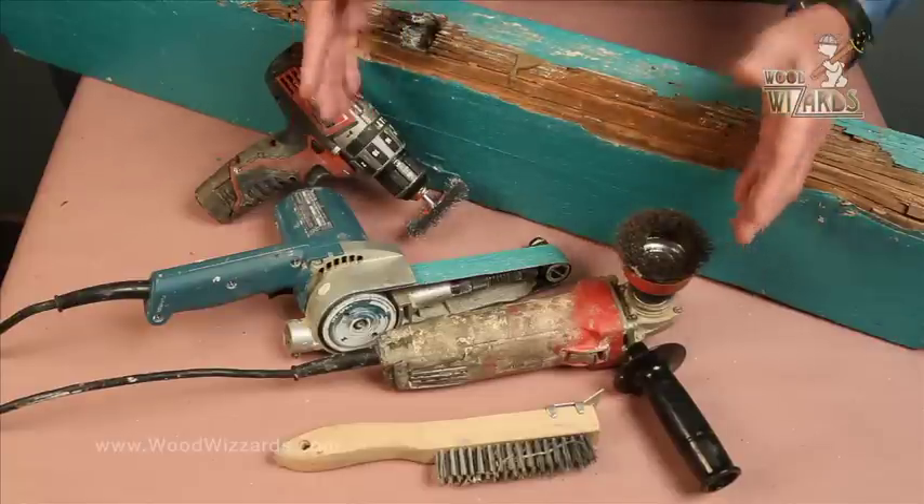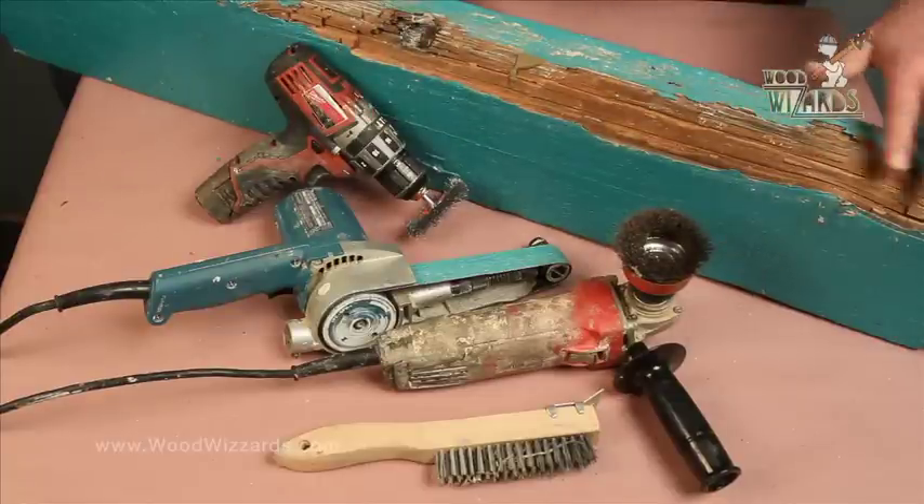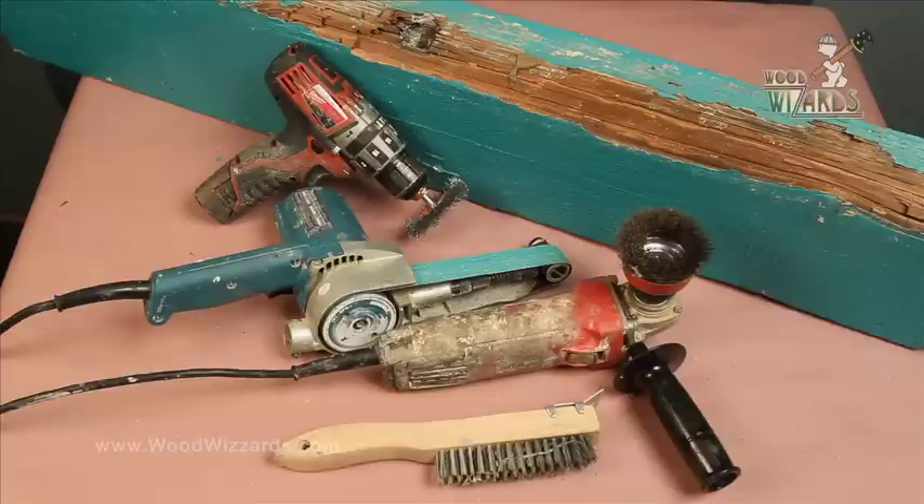These are great tools to use. How would they go about doing that? There are a lot of different ways we can do that. If we're on a job site, just the hand wire brush will get down to where we need to be. Otherwise, we use some power tools to remove that rotted or termite portion. Whatever you basically have will work. There's no set amount, but you want to get down to where the wood is lighter in color.